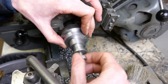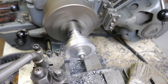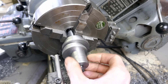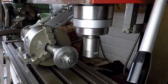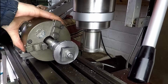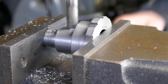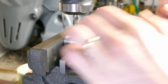I'm now holding the work on a stub mandrel to machine the remaining outside diameters. The stub mandrel ensures that these remaining faces and diameters are concentric or perpendicular to the axis of the workpiece. Checking for a perfect fit on the mandrel. Now transferring the three-jaw chuck bodily to the milling machine and a dividing head to machine the slots for the ratchet. Machining the spanner flats on the indexing sleeve. I'm supporting the work on a parallel in the vise to ensure that the two flats are parallel to each other.